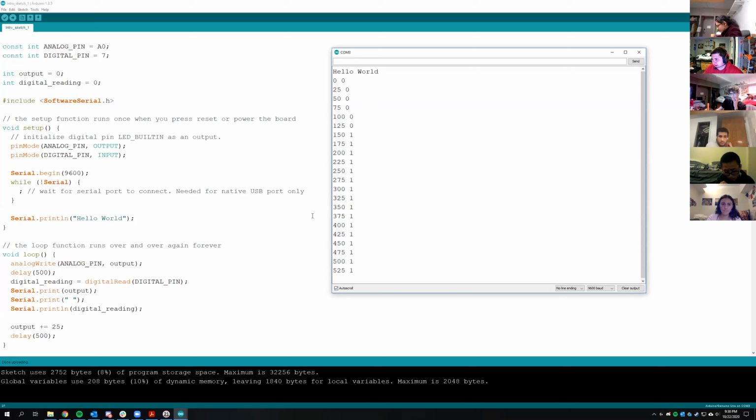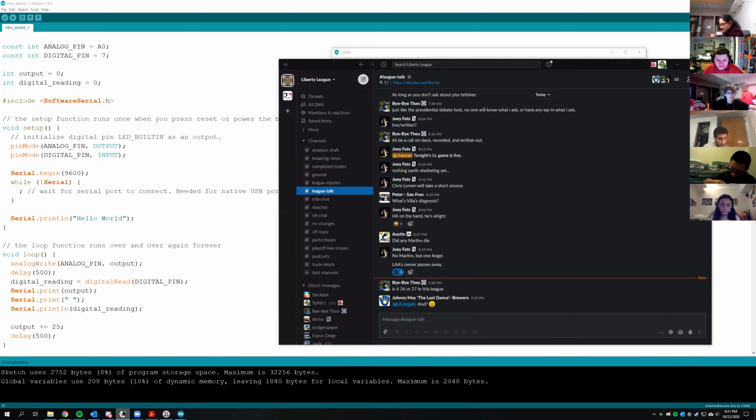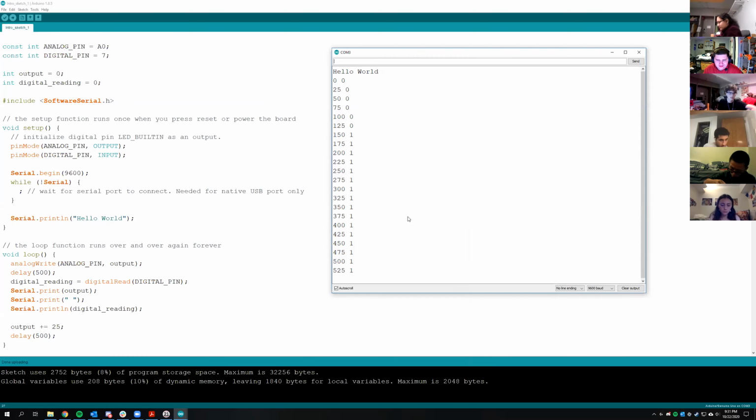John, Matt, and Emma, were you guys just reading without a delay? No, I even had a 500 millisecond delay between each of my reads, and it was still. And you were still getting ones and zeros. Right. It's literally just a jumper cable between 2 digital pins, right? I think so. Right now it's 11111001000001, and I've digital written 190. Interesting, indeed. Huh. Okay, maybe it only works on my board, and maybe I was just wrong.